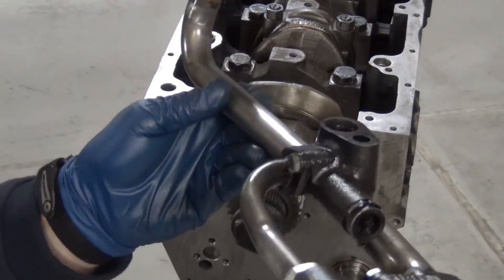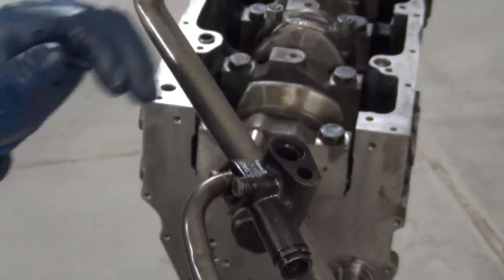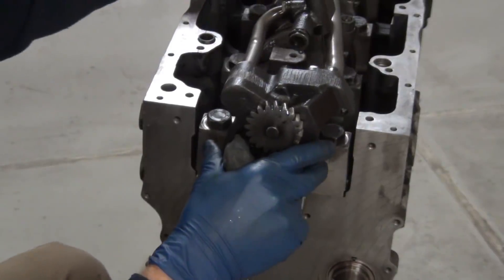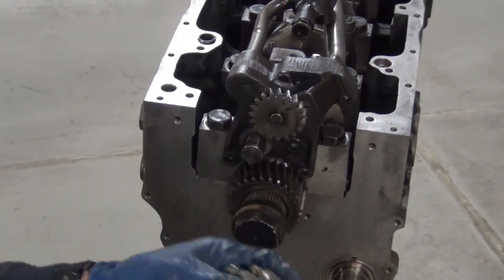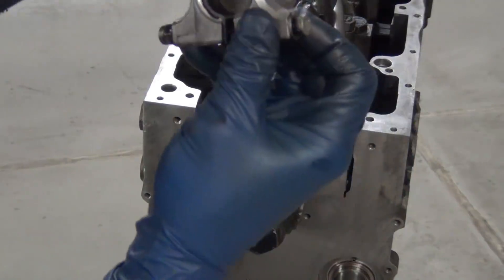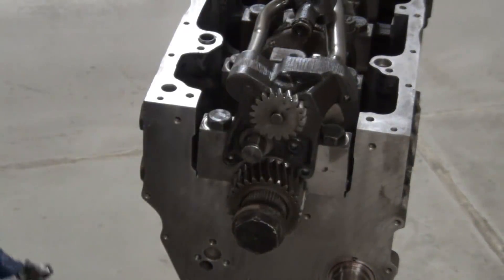The oil pump — there's nothing wrong with it other than the bolts weren't tightened. We're just going to slide that on; it's a very precise machine fit. Then we take our bracket for the back side — this is kind of like the Chevy 3.5 or 5.3 liter in that these just snap together like that and rotate around.